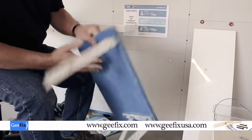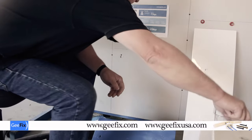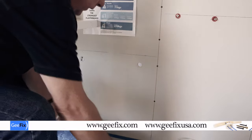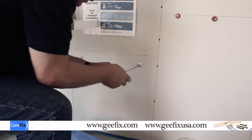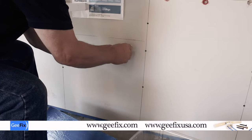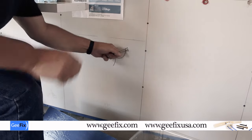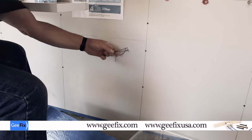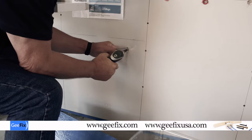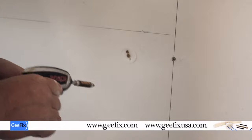These brackets could be any shelving bracket, whatever you put on there, onto the cavity again. I've marked and drilled the first hole. I'm going to put the other one in now - put it vertical or near enough. Start the screw, you'll feel it when it's started, pull on the cord, then put in the two side screws.